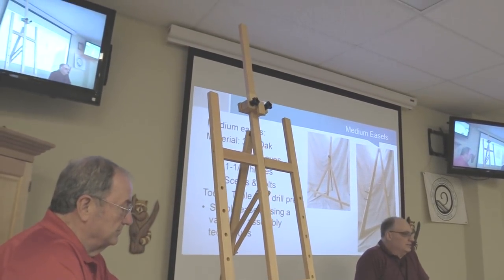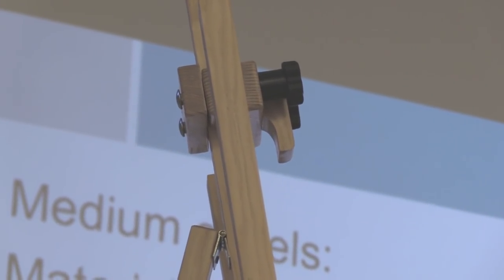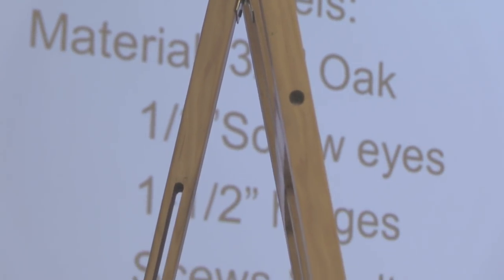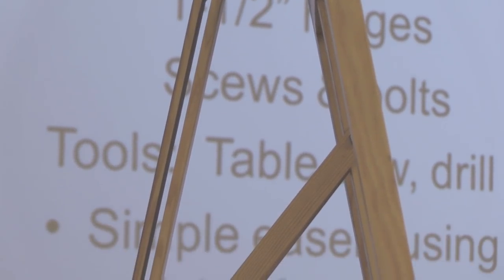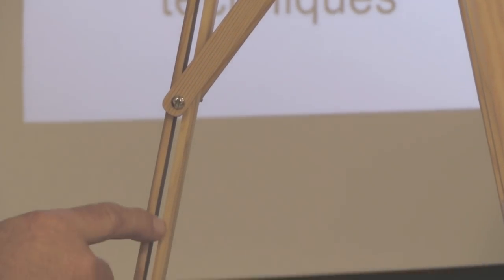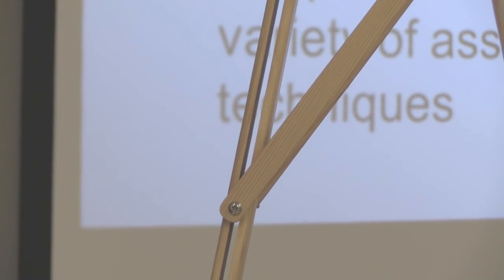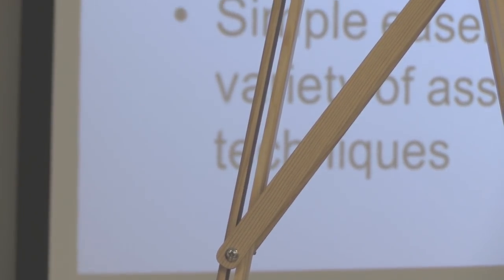That's probably the largest easel I made. And again, I just looked at pictures. As far as the overall dimensions and stuff, that's what I wanted to make it. Talk to us a minute about how you got this feature in here, this through dado, I'd call it. I have a router table, so I just put a straight bit on there, marked my drop and pickup points, and then ran it through about, I don't know, a little under a quarter each time, and then flipped it over, ran it through, and then took it up a little bit and kept running it through.